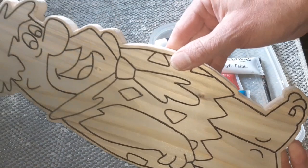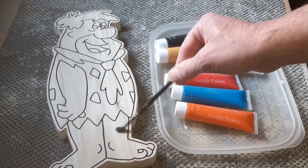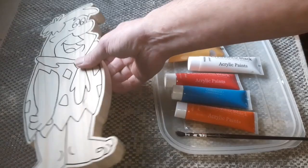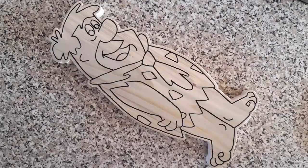Now I'm going to use acrylic paints today. I do like to water them down slightly, just so it makes more of a stain than an actual paint itself, and it will just soak in nicely to the wood. We'll paint the full piece the way it should be painted, hopefully, just leaving the little edge all the way round. Once that paint's dry, we'll put boiled linseed oil on the edges and down the sides just to darken that wood back again, and then once that's dry we'll give it a full spray with crystal clear or yacht varnish to finish.